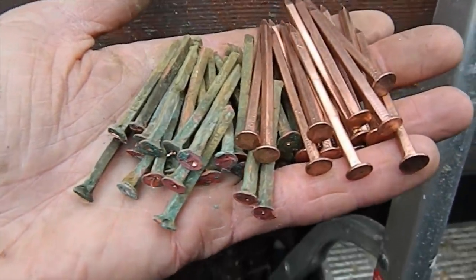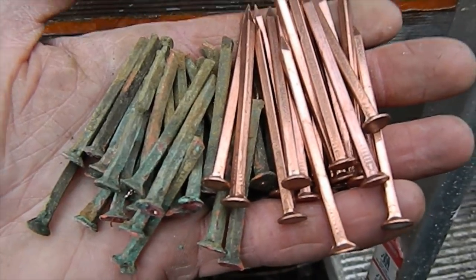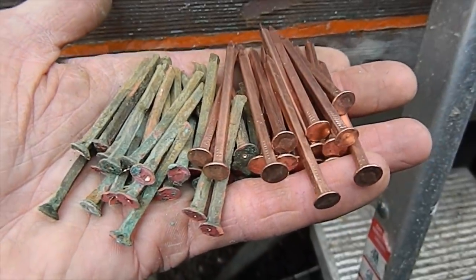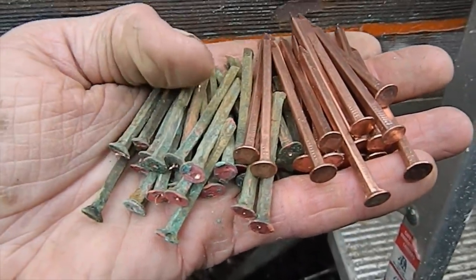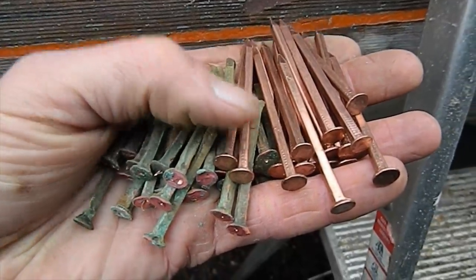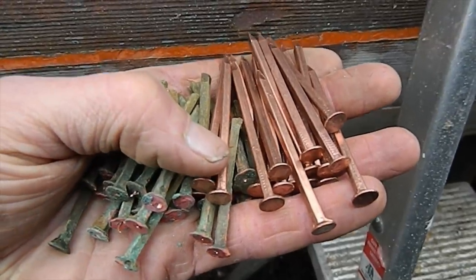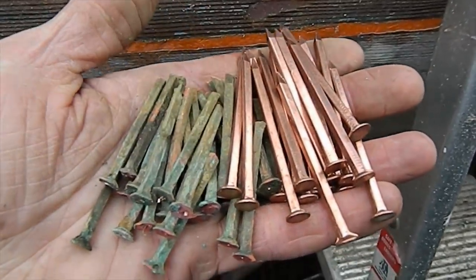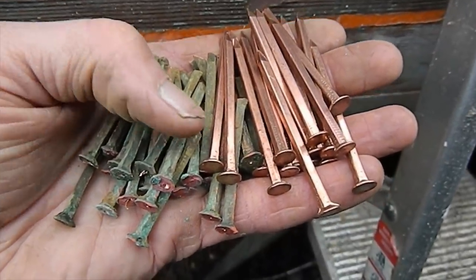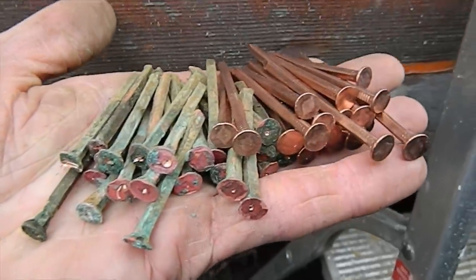So we're looking at one rib's worth of nails — old versus new — quite a difference. We need to size up the new nails because the holes that have already been put in for the old ones may not swell back to the same size in the future. So we go up a fraction — basically the next size up. Depending on what boat you're working on, take what old nails you had, size up one, and go for that. And you should have a nice snug fit.